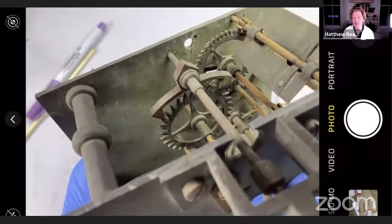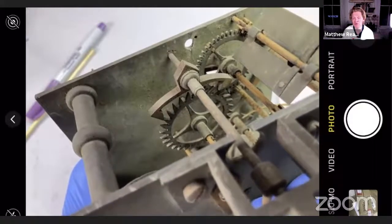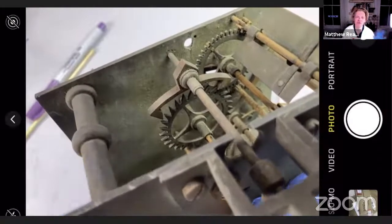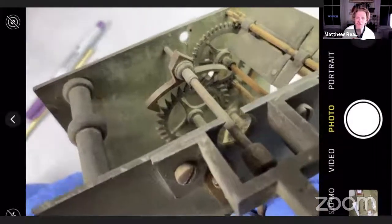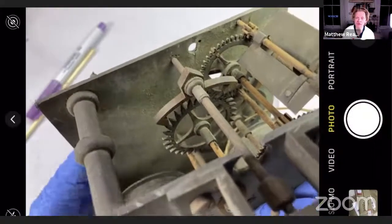However, as I said, what we can do is put a slip probably on the exit pallet only. Get an escape wheel tooth there, slip on there, we can leave it long and we can deal with both drops in one. I reckon that'll work out quite nicely. But anyway, let's look at that when we're a little bit further down the road.